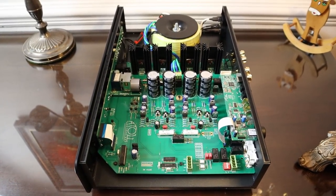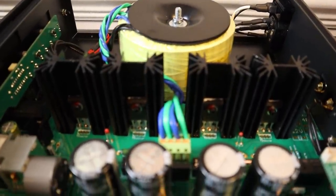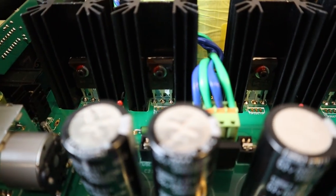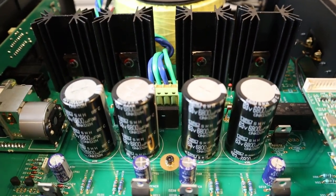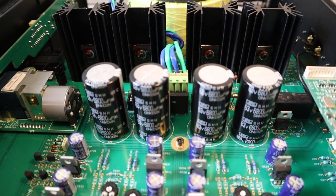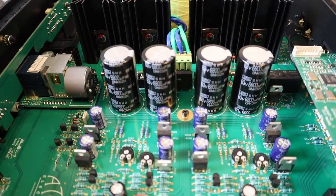I've turned the unit on its side so we can see more clearly what's going on from this angle. What we have is a relatively large toroidal transformer for an amplifier around this price, rated at 340VA. Those four black heatsinks have the output transistors mounted to them — they're by American company Vishay, which is well respected. They're MOSFET transistors, two per side, and MOSFETs have a reputation of sounding a little bit warmer than the bipolar junction transistors you commonly find on amplifiers around this price. Those are the power supply filter caps — four of them, two per side — by another well-respected manufacturer, Nippon from Japan. Each one is rated at 6,800 microfarads, so that's 13,600 microfarads per side and 27,200 in total. Nothing particularly elaborate about that but it's good quality parts.